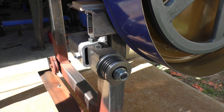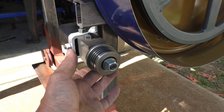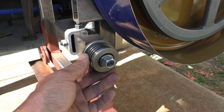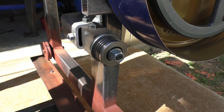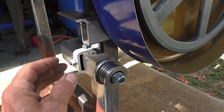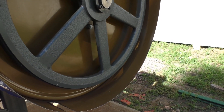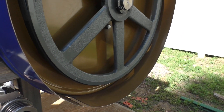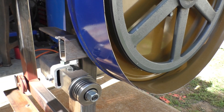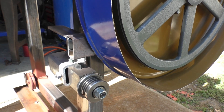As I showed in the last video, I built these guides with the rollers on them — rollers from Cook Saws, hardened, so a good part to use. I had to figure out a mount, so I welded to the bottom of where the bearing flange is and it's bolted on. I still need to add a quarter-inch shim under it because I'm going to push the guides downward to the blade to put some pressure against them.